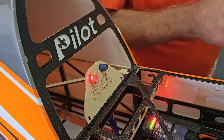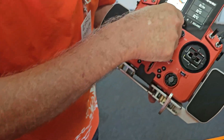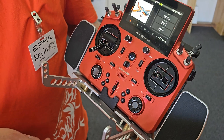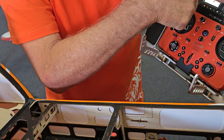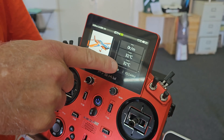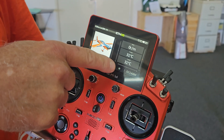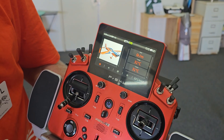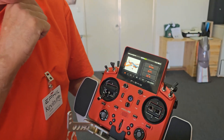That's how I do my remote switching. I'll now turn it off without touching the aircraft — just with the switch. There we go, it's all gone off. The telemetry will go red in a second — one, two, three — there we go. So now I know I'm not getting any telemetry. That's the FR Sky remote switch and how I switch the model on and off.